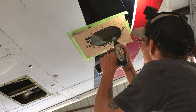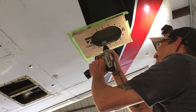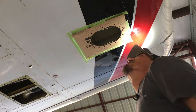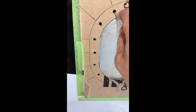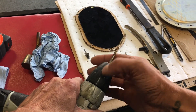This is a very slow and meticulous part. I sped it up a lot and couldn't record it all because I do have to work too. It's just trim a little bit, fit again, trim a little bit, fit again — that's it. It's just a file on a rotary tool on the end of the drill. I like using the drill because it allows me to control it better, but you just take your time, a little bit off at a time, and see how it fits. It looks close to spot on at this point, so I'm going to go ahead and center-punch the holes for drilling. I start with a number 40 drill bit, starting small so it allows me to check along the way. From a 40 I swapped over to a number 30, and then stepped up a couple sizes until I got what I wanted.